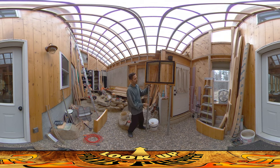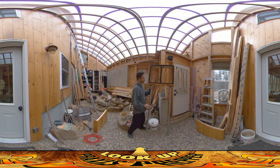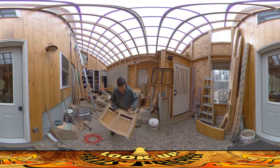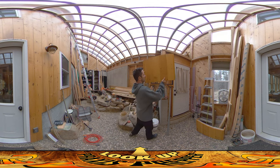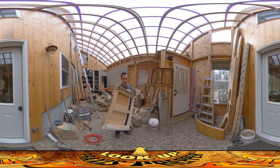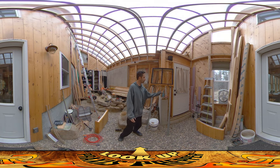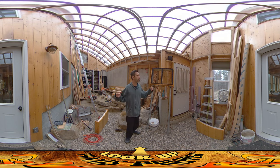The idea of getting it up off the ground as high as possible is that there'll be less dust being sucked in, and also in winter — especially if there was a nuclear winter — you wouldn't want snow burying the vents, since the vents are on the bottom edge. The filters go on these surfaces and these doors hold the filters in place. Air comes in through this mesh material, gets exposed to the filters, and this holds the whole thing on. There's one for each side, giving about 12 square inches of space in the four-inch pipe going into the shelter, and cumulatively on both sides almost 60 square inches of intake space.